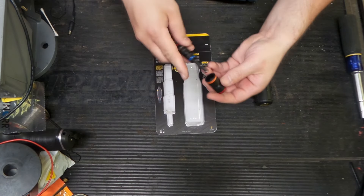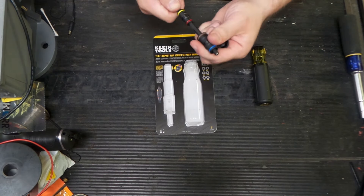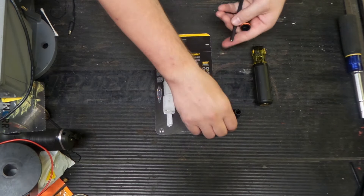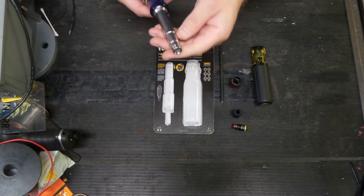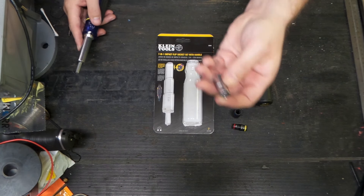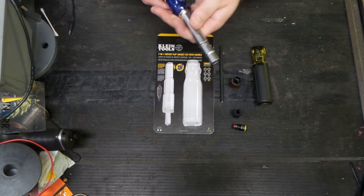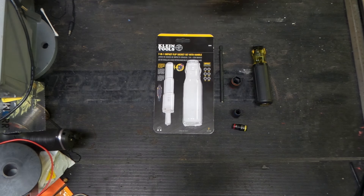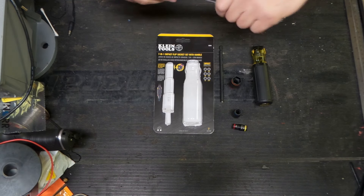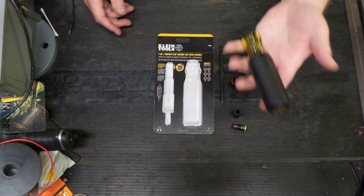You can put any of the sockets at any location on the tool, which is kind of cool. One thing I don't like is it does not have — like this old Irwin — an 11/32nd socket. You might ask why you'd need an 11/32nd, but 8-32 fasteners utilize an 11/32nd nut, so not having that is kind of a bummer. This old Irwin is a different, buildable-style design — an early multi nut driver I got years ago.